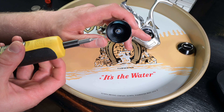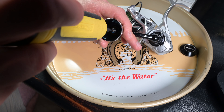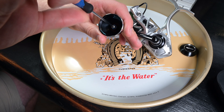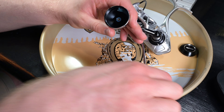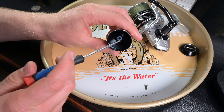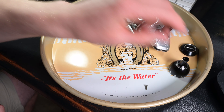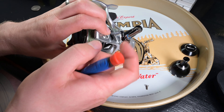I'm going to use this rather standard flat head and we're going to unscrew this little screw here. Alright, so that's loosened up — now we take a micro screwdriver and back it out more quickly. That screw pops off, now we have a sealed bearing that's exposed, so the whole handle knob pops off. We've got this little bearing that we're going to knock out — let's push it out with a screwdriver. Then you have this fantastic bearing that sits in your handle knob. Here at the bottom of the handle knob shaft, we've got a second sealed bearing, and we'll just leave that there.